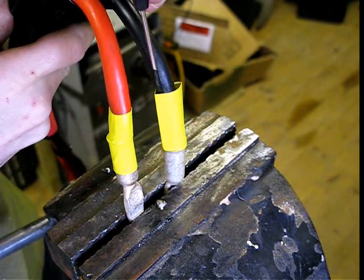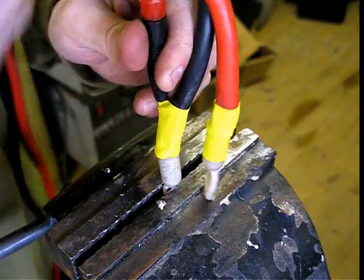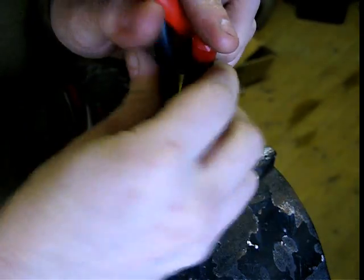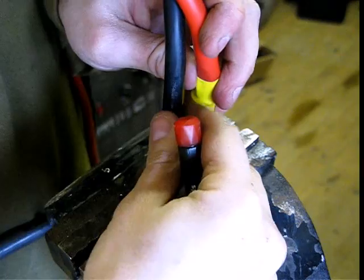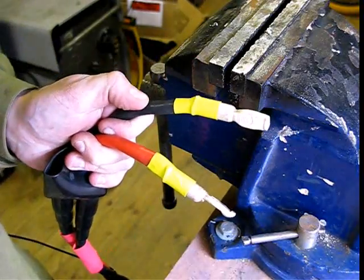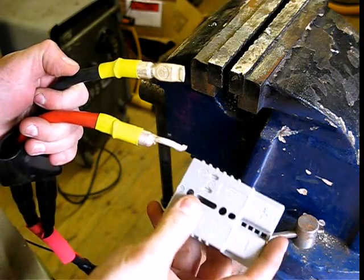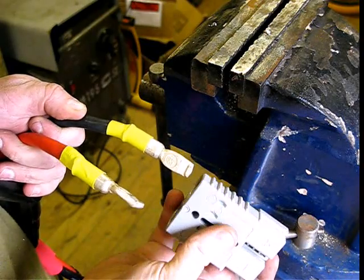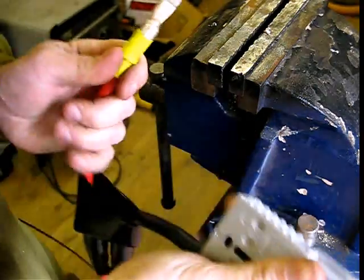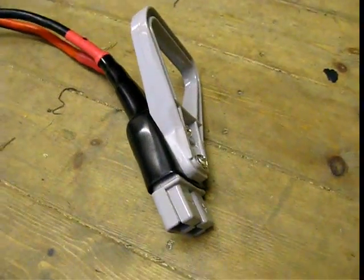A little tip is to get a thin screwdriver, stick it all the way in so it comes out the bottom, and then you can just literally run it round while giving it a little bit of force, and you can work the heat shrink over the joint. Now, you've got to make sure you push the terminals in the right way — this lip needs to be against the flat part there. Obviously make sure you get the black to the negative. And that's literally it. There we go — one complete plug.